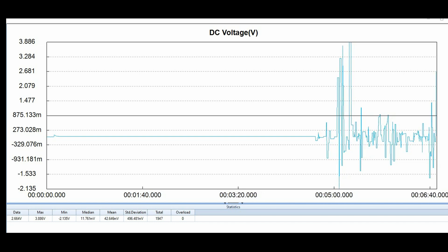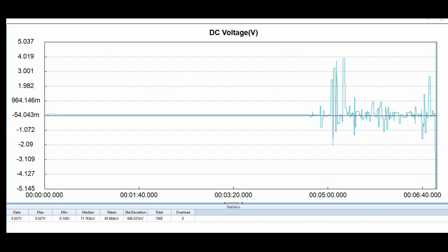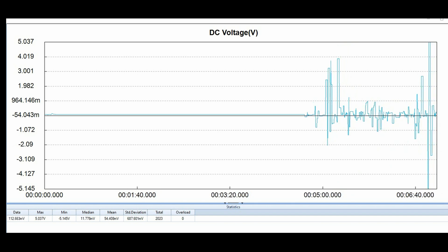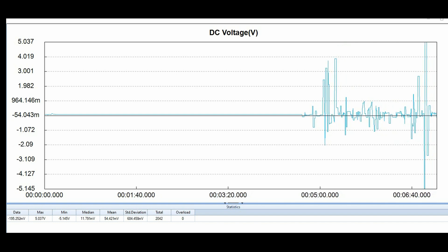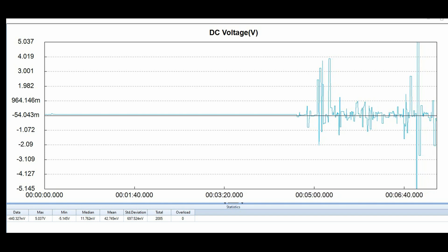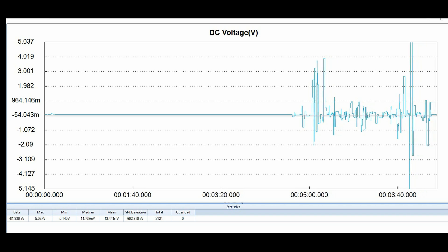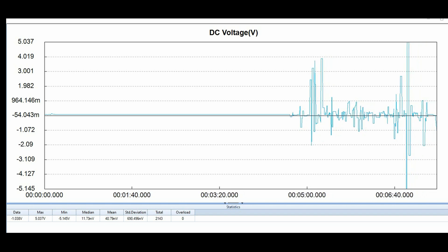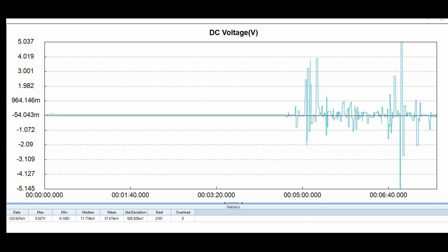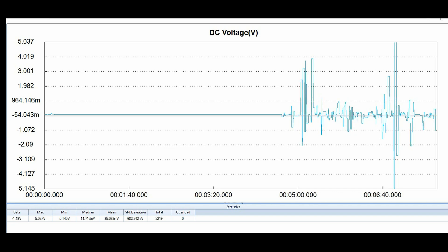I wanted to show you this graph because the first graph shows what this type of problem can turn into — it doesn't mean it's going to. In the first graph, the amplifier only got a couple hundred millivolts both positive and negative, the amp played fine, and that will do no damage to your speakers — the sound quality won't be as good as it could be, but there'll be no damage. But what that problem can turn into is what you see here: five or six volts being put out to your speakers, which is damaging. This is where people think their equipment is broken — when they hear it going click-click and it's not playing. In reality, it's probably been broken for years before it got to this point.